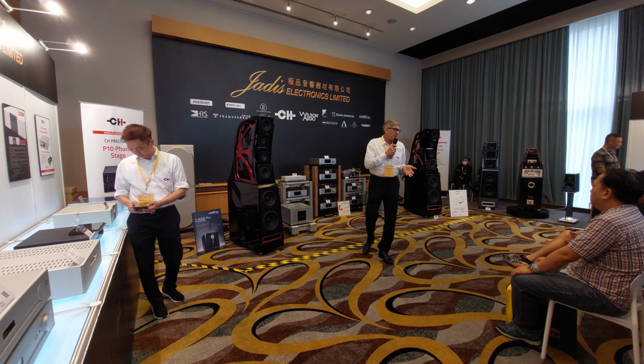Each amplifier is a dual channel amplifier, and we're running off of each rail the Thor's hammers and the XVX. One of the unique features of all CH amplifiers is the ability to control damping. We do it through global feedback. And when we're in this kind of configuration, unlike a stereo amp where we have to use the same value for both, we're actually able to custom dial this in. So I'm using 1% global feedback on the main array and 2% global feedback on the subwoofers, so I'm offering a little bit tighter control of the woofers by doing that.